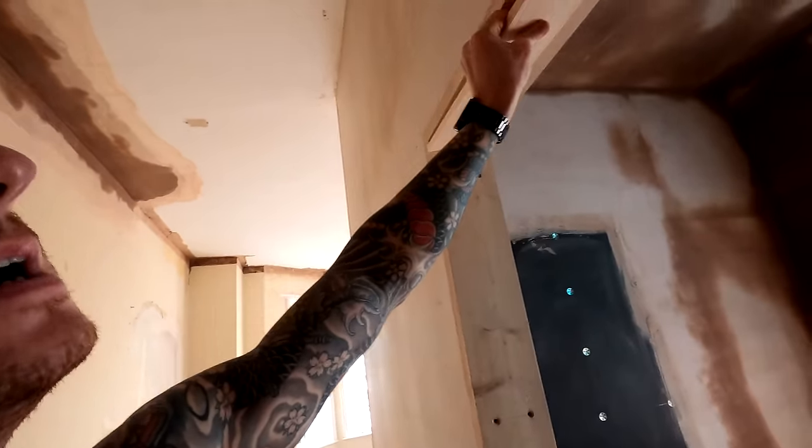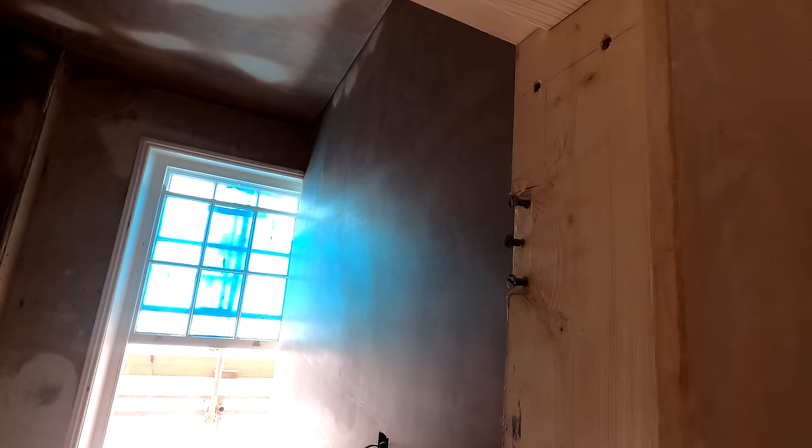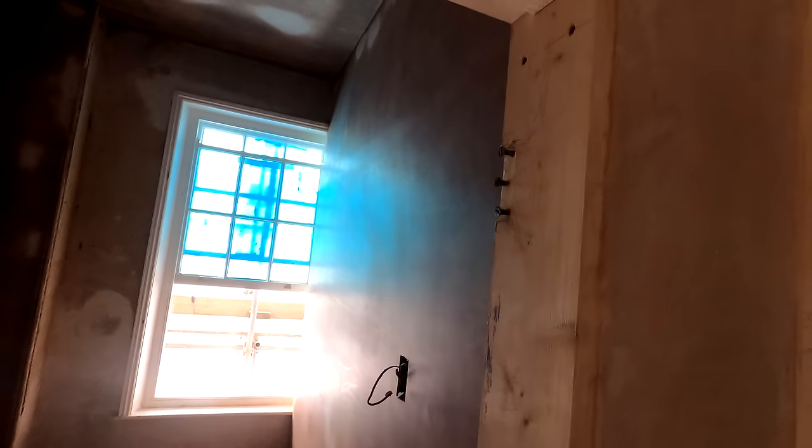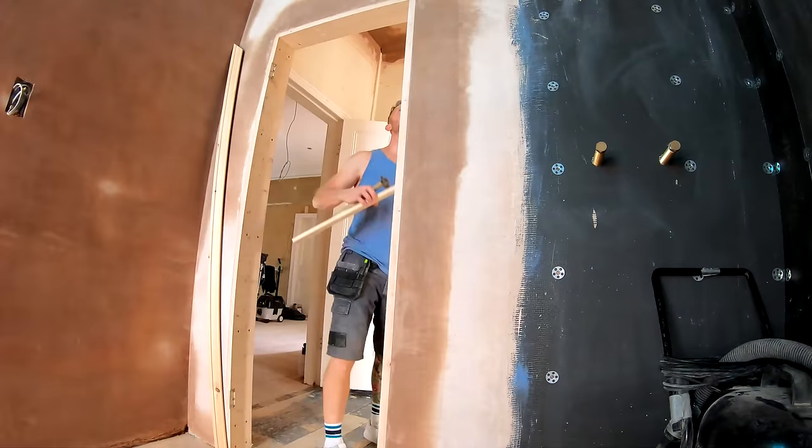I now have all my slamming strips cut to size. I've cut this one down - this is 692mm. You need these to be pretty snug in here. There's the head in there straight away, and then I need to get the two legs cut and we're good to go. I won't permanently fix these at the minute - these will just be temporarily fixed until we've got the door in, just to make sure everything's bang on. The last thing I want is to get these permanently fixed and then have to rip them out because of a fitting issue.